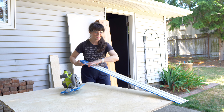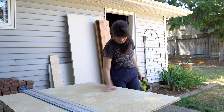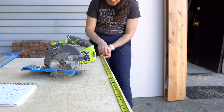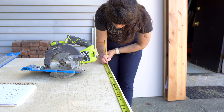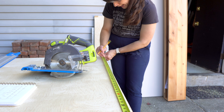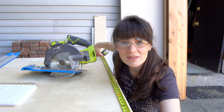Man, I really spent the last few days a little bit worried about that, I'm not going to lie. But we're conquering this. Now that I have it cut down to 42 inches, which is the height of our cabinet, we're going to go the other way and make the measurements for each of our sides and shelves 12 inches. I'm just going down and marking: this is 48, 36, a mark at 24, one last mark at 12, and we'll do the same on the other side.